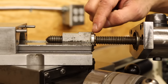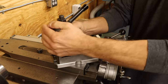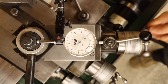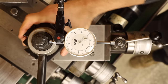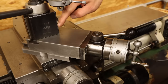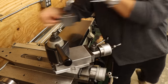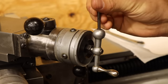But that's not going to work here. Why not? Well, that requires reassembly. I've got an indicator on here, and in one position you can see a few thou backlash. Not bad, but if I move this out just a bit, that backlash is literally soul crushing. The only way this happens is if the lead screw is worn unevenly. So there's no chance of adjusting away the backlash for the full travel of the compound. Which brings me to the crux of this story. I'm going to have to remake this lead screw. And for good measure, might as well make the lead nuts as well.